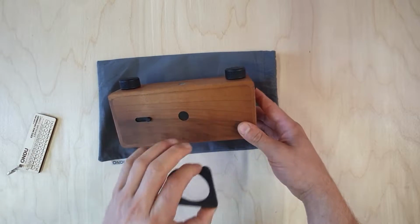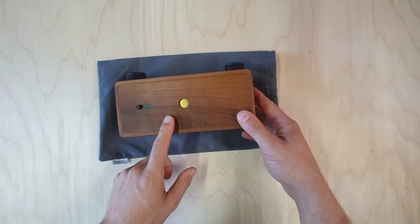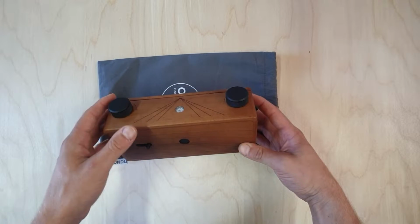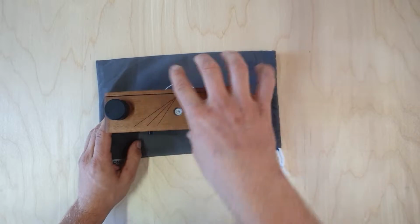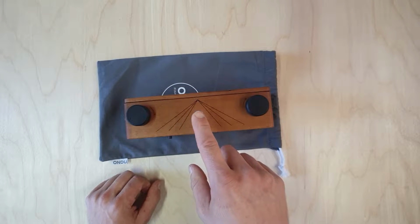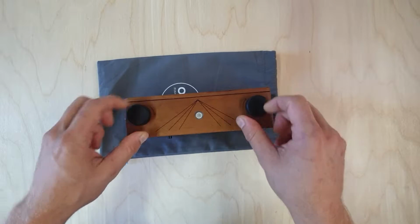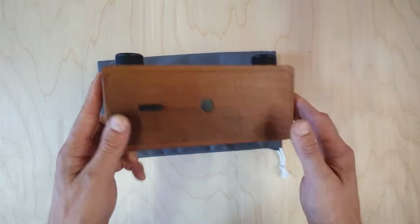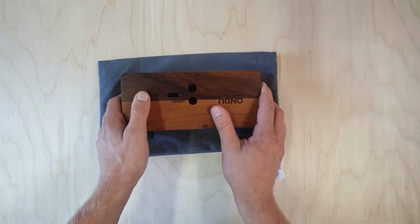The camera features a 0.25 millimeter pinhole with a focal length of 40 millimeters, which gives us an f-stop equivalent of 160. It has both horizontal and vertical field of view engravings, as well as a leveling bulb, indication markings for which direction we have to turn to get to our next shot, strap mounts, a standard tripod mount, and a red window shutter.